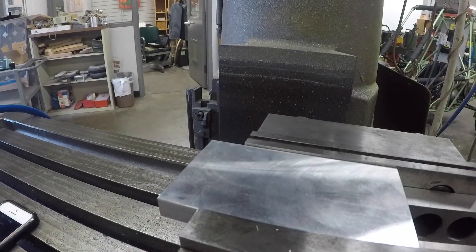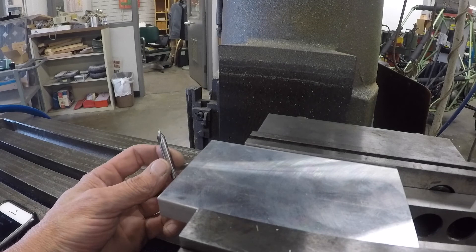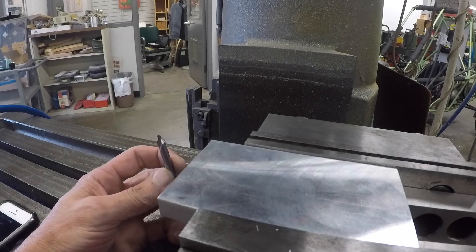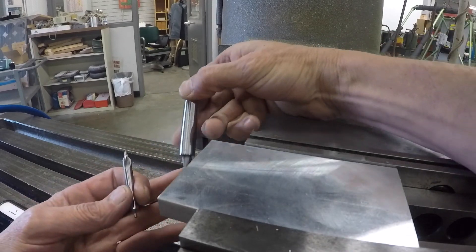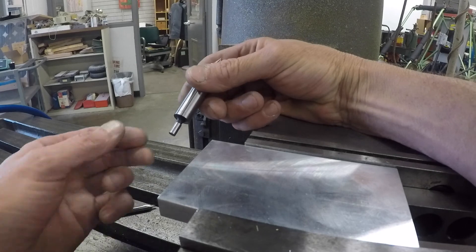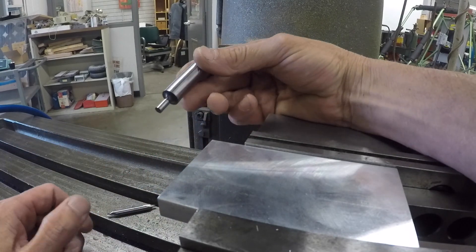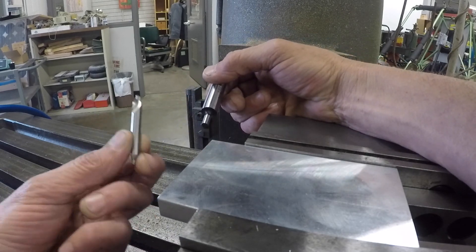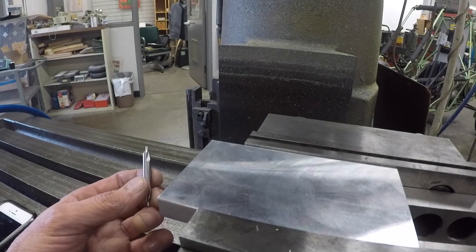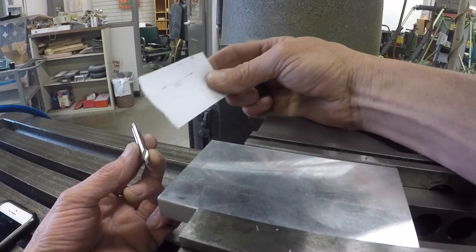I showed you already how to find a corner with a quarter inch center drill. The reason I did that is because often these tools, which are called edge finders, break and are not available in the machine shop. They're not cheap — probably forty or fifty dollars — where a center drill is three or four dollars. So using a piece of paper as a shim is a way to find the edge, which I'm going to show you again. I can tell from the questions that either you didn't watch the video or you're unclear about this process.